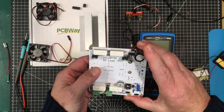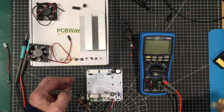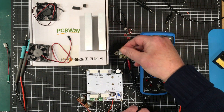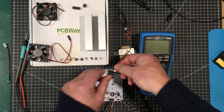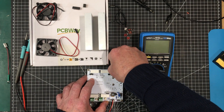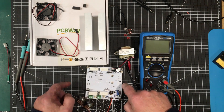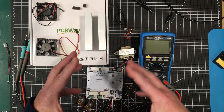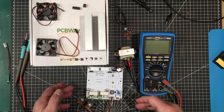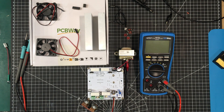I'm not going to complete this project today, but I just want to get the initial stuff going — get it in running order. I have here a half-amp 12-volt transformer. Should be plenty enough. Each of the fans takes 100 milliamps full blast. So we're going to need three fans. The only other things requiring electricity from this transformer are the op-amp and the microcontroller. So if we do the math there, we're roughly around 320 milliamps. This should do a really good job of it. Let's get that turned on before we put any op-amps or microcontrollers in it and get things set up.